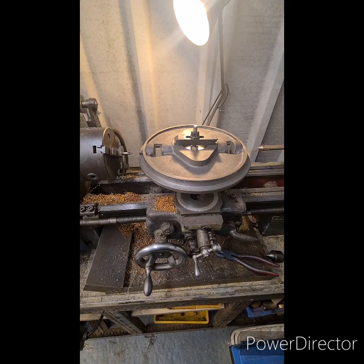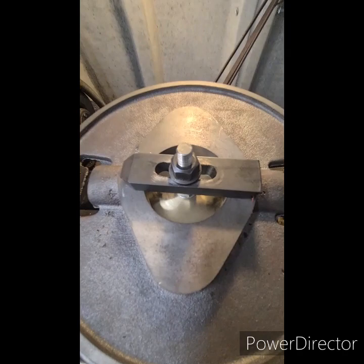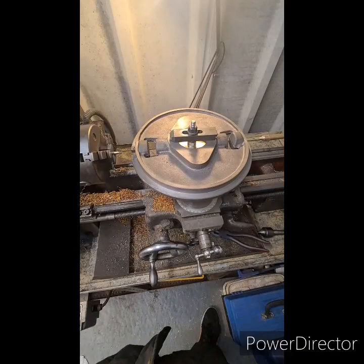Here we are drilling the holes in the differentials for the bevel gears. As you can see, I've done both sides, put my center pointer in that side. I've just center drilled this one. Did it just by making up a mandrel that I found the center of, using the center locator, and that means that's exactly in center. Once I've drilled one side, the other one should be perfect.